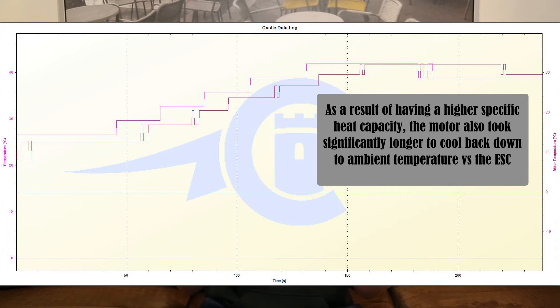In conclusion, what we've identified is that the power produced through the driven motor gets dissipated across the entire braking circuit — that includes the brushless motor, the leads running from the motor to the speed control, and lastly the speed control itself. All of these components are going to heat up, and which one heats up most is based on whichever has the highest resistance. If I had pressed harder on the brakes with a higher braking percentage programmed, I would expect the motor to produce the most heat, because the speed control at a higher braking threshold would have lower resistance — closer to that dead short — and zero resistance theoretically produces zero heat.